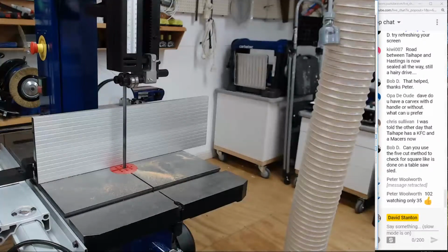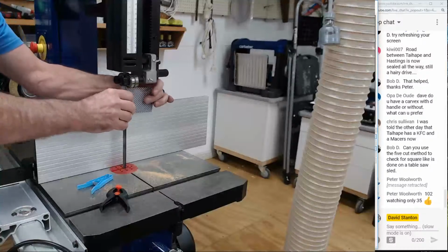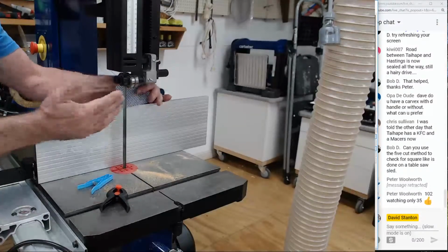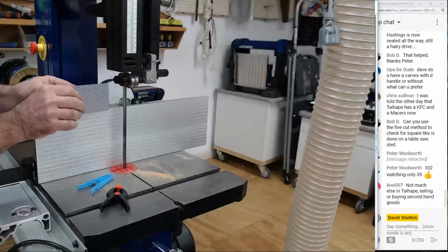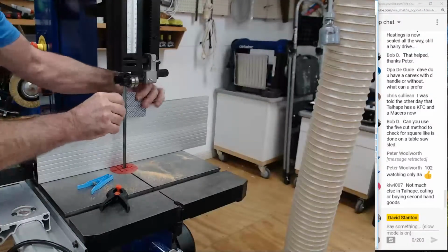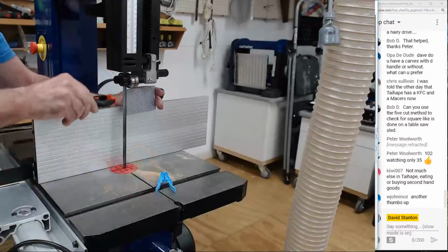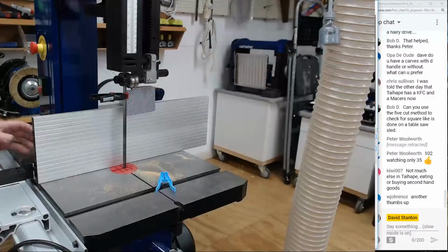Now the reason I had a clothes peg here was because we're going to put this behind the set on the teeth. If I bring it all the way to the front, the teeth have got set, you know, left and right, and they're going to tip the playing card that way. I want to put the card on this way, and this clothes peg that I got hasn't got much grab. It hasn't got the grab that this thing's got, so I'm just going to put that small clamp on, and you can see it there.